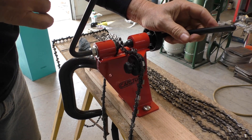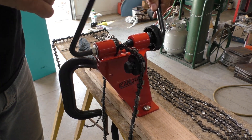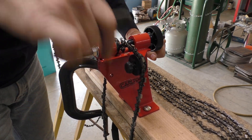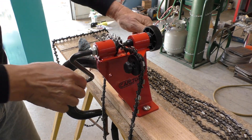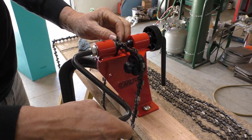Things seem to go a little smoother if you put a little oil on the tool area. If you watch, the chain will kind of wrap up one direction as you're cranking down on it, but once the rivet gets down to where it's against the plate, you'll see the chain change direction. See how it jumped back the other direction once the rivet head hit bottom and the tool hit bottom on the drive link.